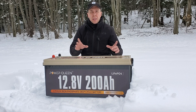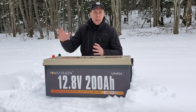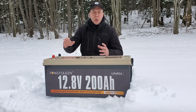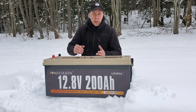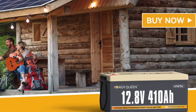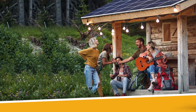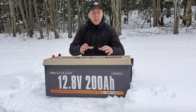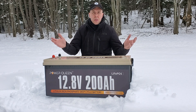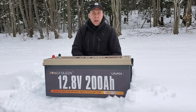There are a lot of applications for lithium iron phosphate. The first thing to know is it's not a starting battery — you're not going to put this in a vehicle, a tractor, or a boat to start the engine. But it's really good for running a trolling motor in your boat — much lighter than lead-acid for that capacity. It's going to work great in a shed, barn, or cabin. For camping, lithium iron phosphate is starting to be used in solar generators, and it's also great for house batteries in your boat or camper where you've got solar, you're recharging them, and you want full capacity without adding a lot of weight or any fire hazard.